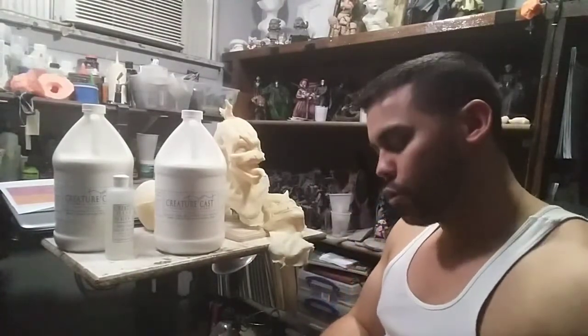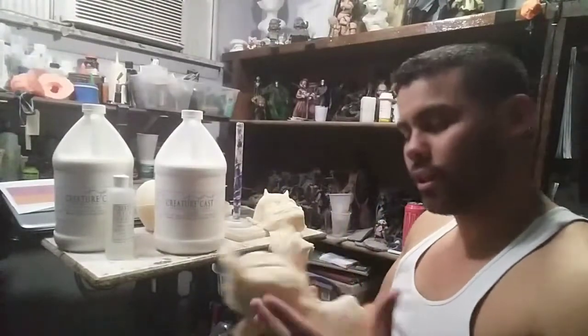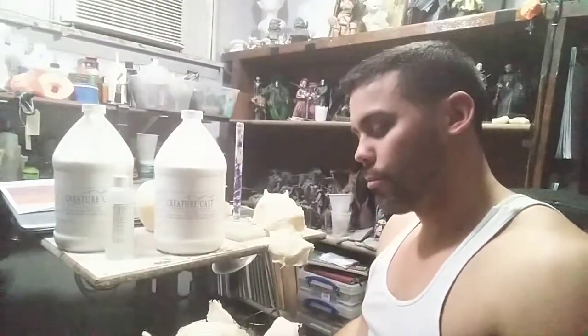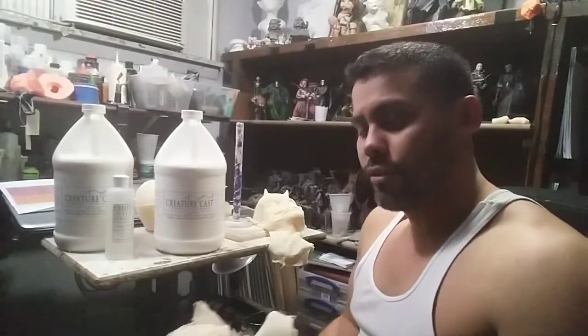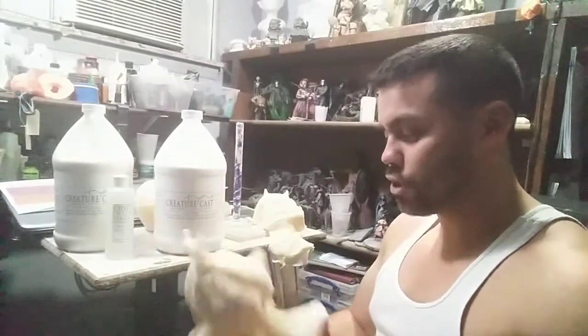And what's really nice about the material and the idea is that you can cast something that's hard and rigid, but not have to make a silicone mold. You'll be able to do it out of a plaster mold, which everyone that uses silicone knows will save them some money. And it's slush cast, so it's a lot easier. You don't have to mix the resins. And the other thing is that with resin, since it's a 2-part mix and that's how it has to set, there's always going to be an area where it's thicker or thinner in other areas, or it's going to set up in one spot and clump up. And there's not as much of an issue with this.